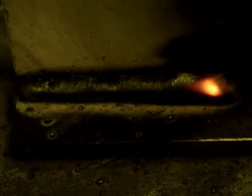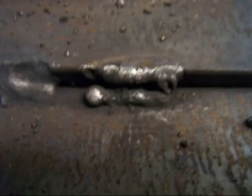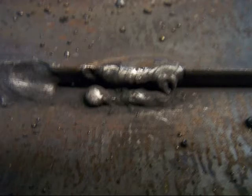Farmers everywhere swear by them. It's probably what you learn to weld with. Here's an example of what happens if you do it wrong. You can easily get a wormhole bead on each side and slag or nothing down through the middle. And I get people asking me all the time about what's happening with their 6013 welds like this.